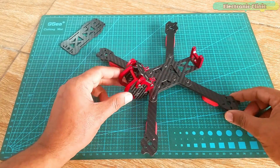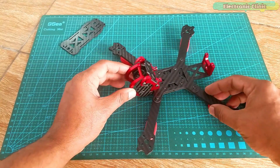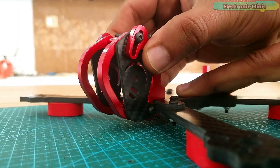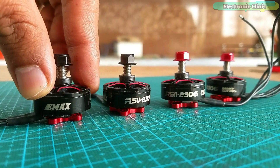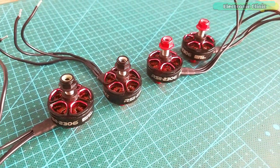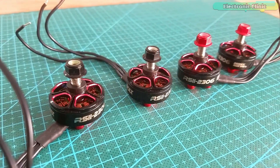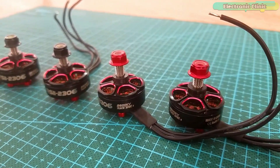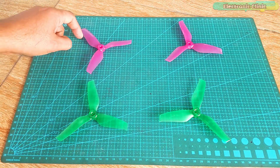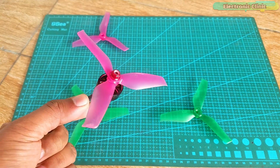You can install a camera on the front. I will explain this in my upcoming video once I learn how to control this mini beast. You can also fix another camera on the top plate for recording high-quality HD video — the plate is movable so you can adjust the camera angle. I have the Emax second generation 2600kV brushless motors, compatible with 3S to 4S LiPo batteries and 5 to 5.5 inch propellers. These motors are lightweight at around 26.6 grams each. Motors with black color nuts are clockwise, and motors with red color nuts are counter-clockwise.